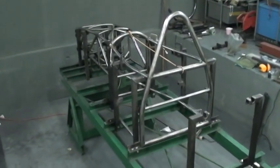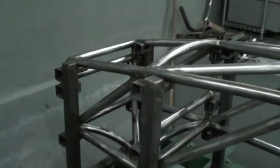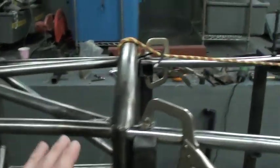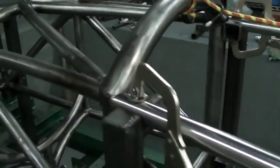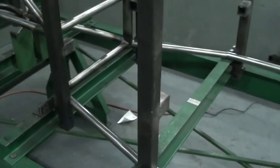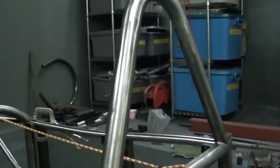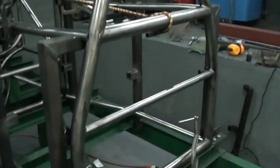This is the state of the car as it is now. The frame is finished from the nose back to the front roll hoop — it's all welded up to there. The tubes are just stuck in place back to the main roll hoop, at least the four outside frame members. That was just finished fitting today. It was a lot of work to get the roll hoop to fit properly, since it has to be correct in three dimensions at four different places.